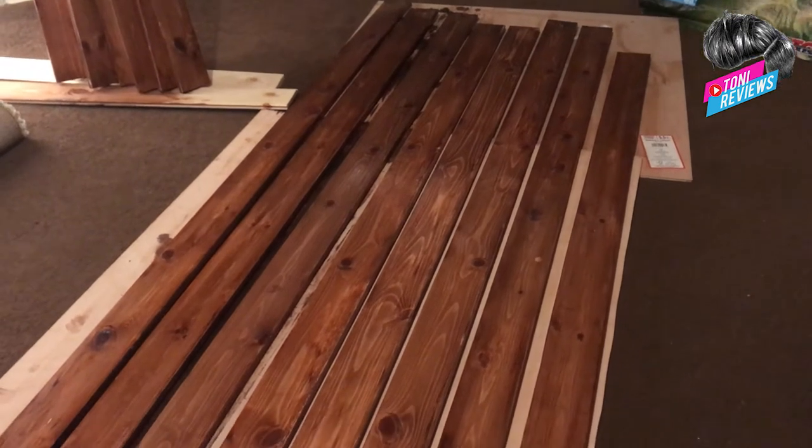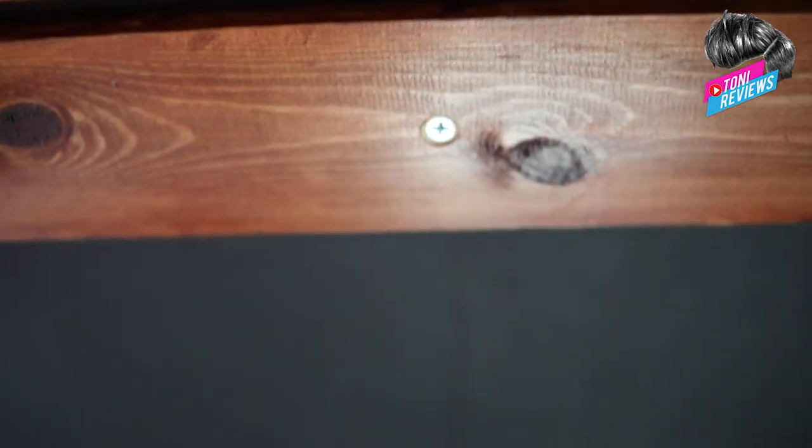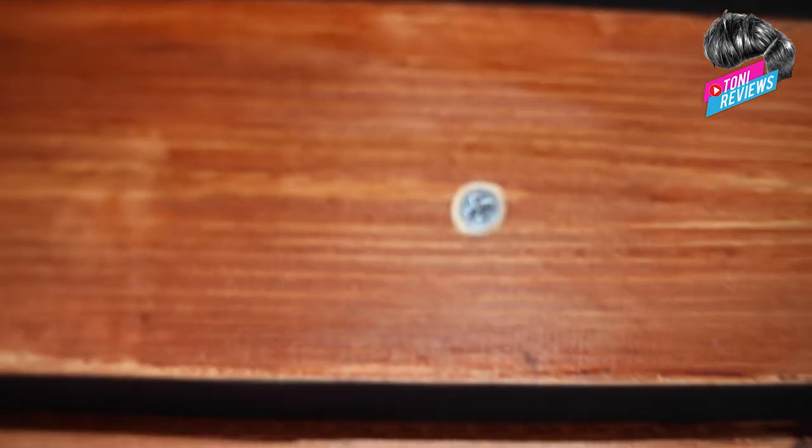This is the slat now installed. That's obviously where the beam is and where the boards meet — it's been filled and painted with flexible wood filler. You might see a little hairline line, but honestly you're not going to see that through the actual wood slats. Through the slats you can't see the join at all, which was my main concern. Pretty happy with that.